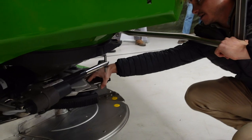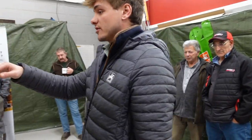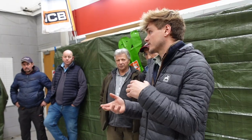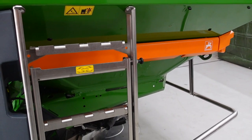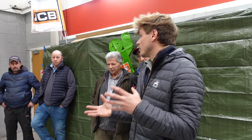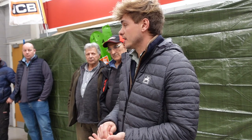This blade here flicks over to give a shorter vane so you're not throwing it as far. We also have an agitator system inside the tank. If the agitator feels resistance, it will reverse — because if it's resistant going forward, it can't break up clumps. If there is a solid clump in there, it'll reverse and also let you know that something isn't quite right.